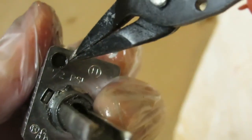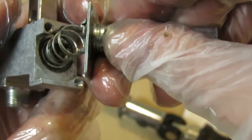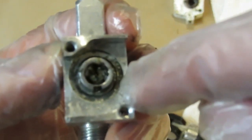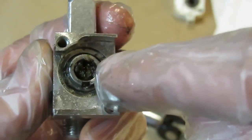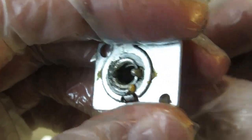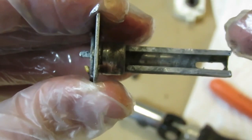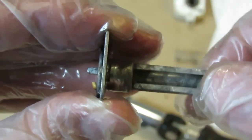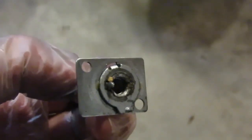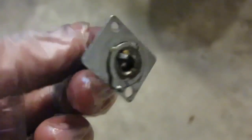These are a couple of bolts to remove — they're 3/16th — and here it comes apart. Here's the actual valve. Like I said, I've already taken one of these apart. Even though these two parts are also aluminum, they were not seized together — the actual valve part is moving. The problem is with this little shaft — this thing is seized and not moving. I should be able to push this down and twist it, but it simply won't. I need to move to the garage because I don't want to do this on the kitchen tile floor.